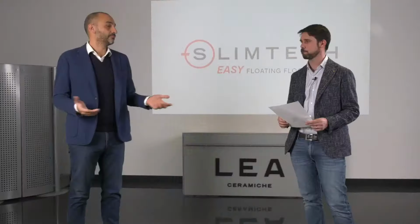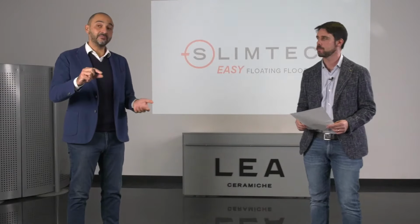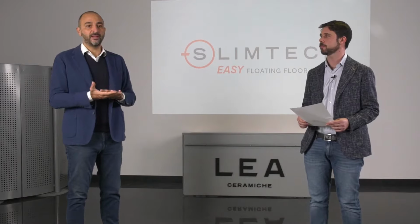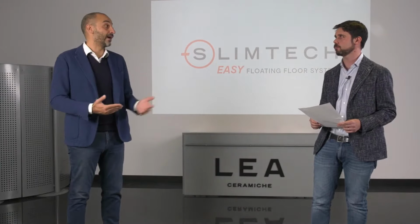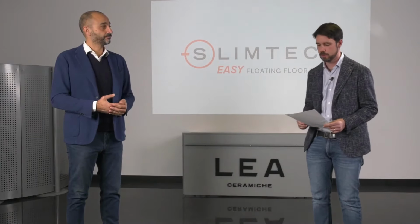Is it possible to use Slimtech with a heated floor? Maybe they are asking in case of a pre-existing or a new floor. There is no problem at all, thanks to the thermoconductivity characteristics of the mat and also of Slimtech, together with the very low reduced thickness. You can use them in any case, because in 7 millimeters the transmission of the heat is really immediate. So it is suitable for a new floor, with a new screed, but also for an existing floor. Excellent.